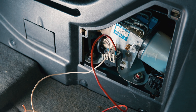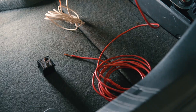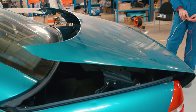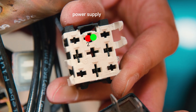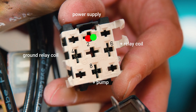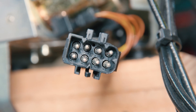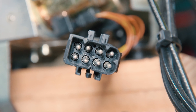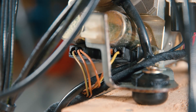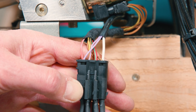Rare but not entirely impossible is the failure of the pump control relay. By simply bridging this socket, we can gain insights into the power supply and the readiness of the pump. It also helps us pump oil out of the reservoir. Power supply is red-green on socket 2, pump positive on 8, ground for the relay coil on 4, and on socket 6 the control positive for the relay coil comes in with wire color pink-red. Further along the pump cable you'll find this 8-pin connector. In addition to the wires mentioned, there's yellow for valve positive Y1, green-brown for valve positive Y2, and two violet wires for valve grounds, plus the pump temperature sensor and the pump ground, which is white here.